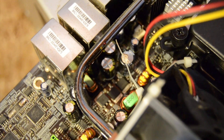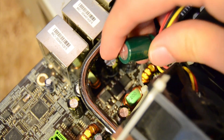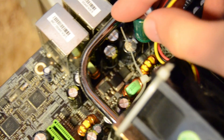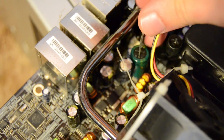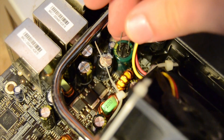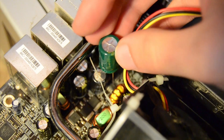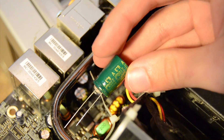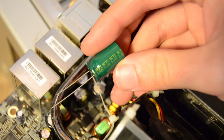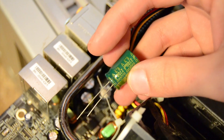I am a little worried about the replacement capacitors that I bought. They are the same voltage and same capacitance, but they are fatter and shorter — well, actually they are the same height, just quite a bit fatter. So they might have to be lifted off the board a little bit. But I got the same voltage, same capacitance, low ESR, 105 degrees Celsius. Hopefully these will last a bit longer, and I did order quite a few of them.